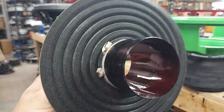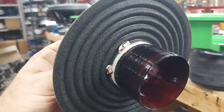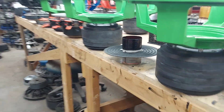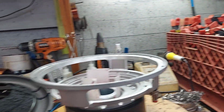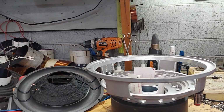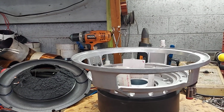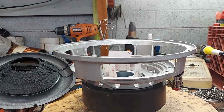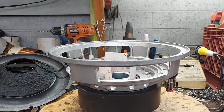It uses a Kapton former, which I'm not a fan of, but the gap is really, really thin. It's a 4-layer. If I had to do it over again, I would have used copper, probably a really thin gauge, like a 22 or a 24 gauge. Which is fine. But I think that's all I want to tell you about. So I'll mark this as the JL Audio 10W7.